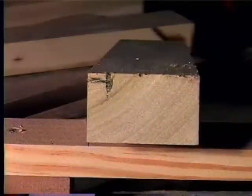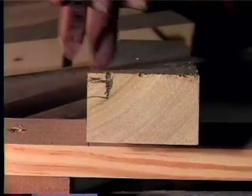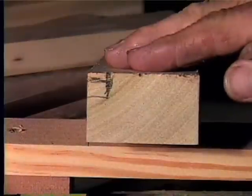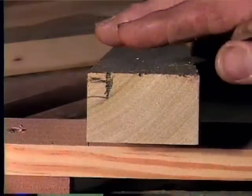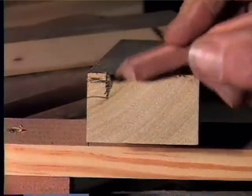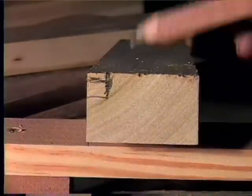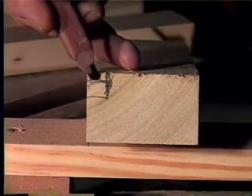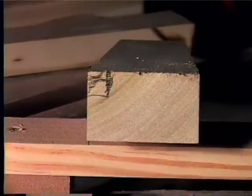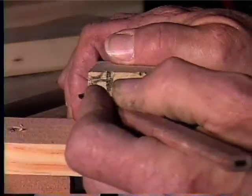Okay, we come back a 1/2, and then we're going to go down. Then we're going to come 1/2 inch from the top, as we're looking at this from the top, which is really the back, but I don't want to confuse you. As we're looking at this right now, we're going to come down a 1/2 inch, because most leaded glass are usually a 1/4 of an inch thick. Sometimes they're even a little thicker. So we're going to go down 1/2 inch so we can make sure that we can get some glazing, because that's what this pencil mark here is. We're going to get some glazing across there. So we're going to come down there 1/2 inch, 1/2 inch back.